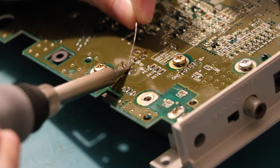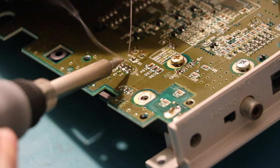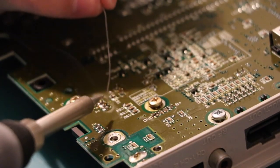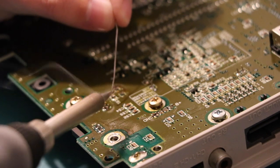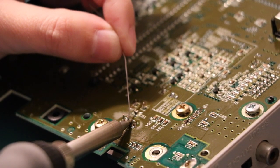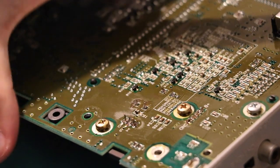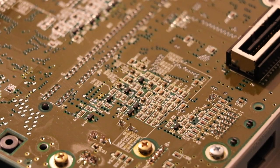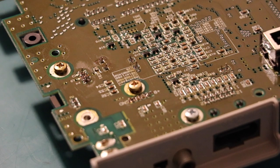Oh, I've got test points on the underside. That's good to know. Feed a bit more through on this one. Looking good. Alrighty, so let's get some scissors and trim those legs, so we can test after reassembling.